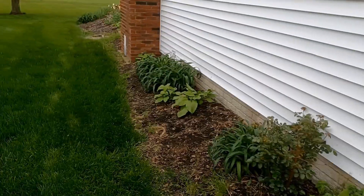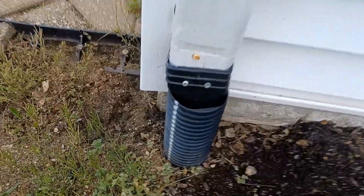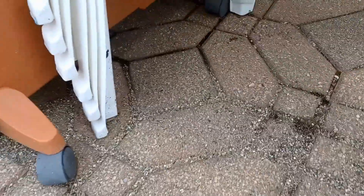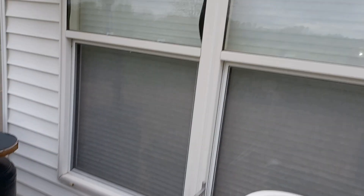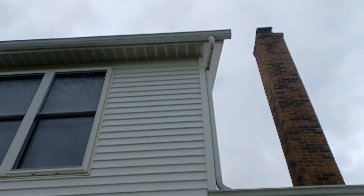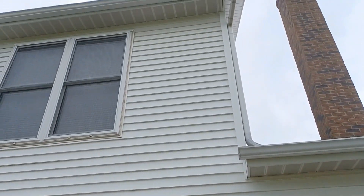So let's go around back here. You can see things are mounded up and graded away from the home very well. Here's the back downspout — three-inch corrugated pipe — goes out to the front. You can kind of see the erosion a little bit right here, but the real problem is over here. Can you see the gravel, the sand? This is from an overflowing gutter — it's just washing out all the sand that's between these pavers. Don't forget to look up. You see that gutter, how it comes down and splashes across the lower roof, and then it comes down the side where I just showed you. The gutter's overflowing right there.